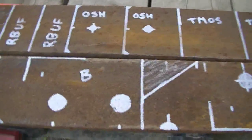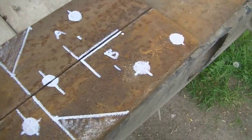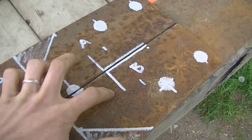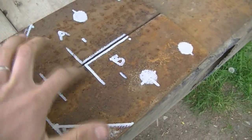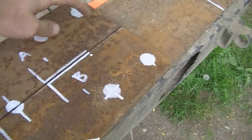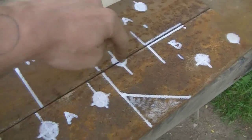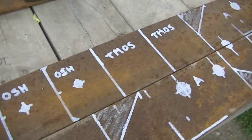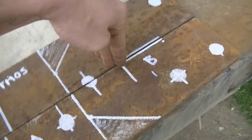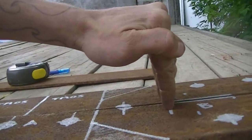I've got two pieces. It'll be 8 inches wide, roughly, give or take like an eighth of an inch. This is basically what it's going to look like — Part A and Part B. I'm going to have to weld them together. These four holes will be burned out so I can rosette-weld it to the frame. That's going to be where the spring bolt goes.